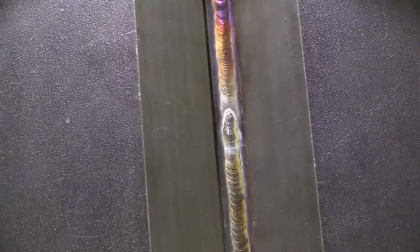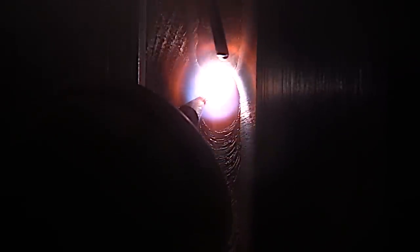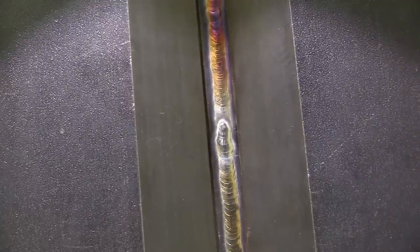We're going to take a look at that at half speed now. I'm almost there tying in, now I'm slowing down a little bit, making sure it has time to fully blend and penetrate. Then I add a little less filler until I'm not adding any more as I keep traveling, slowly letting off the foot pedal, tapering it down into a little teardrop of nothing. Continuing to travel while I let off the foot pedal gradually — that is the secret there.